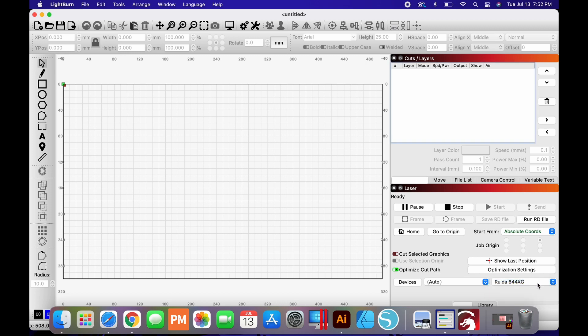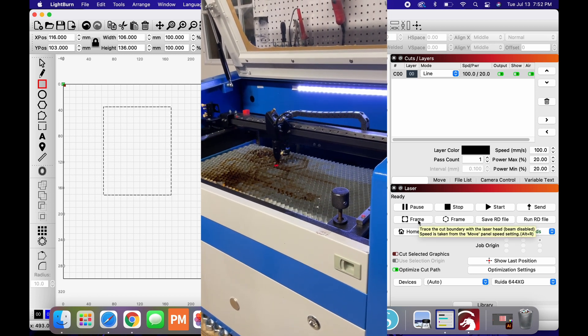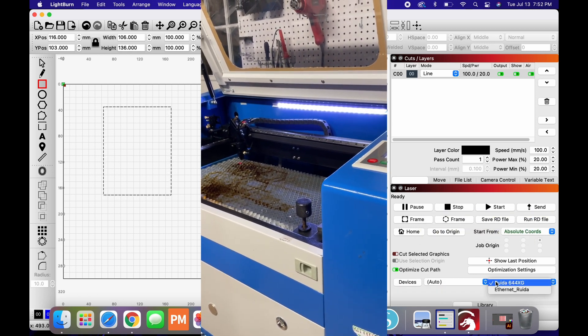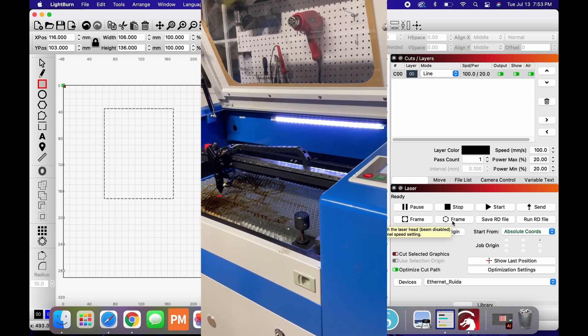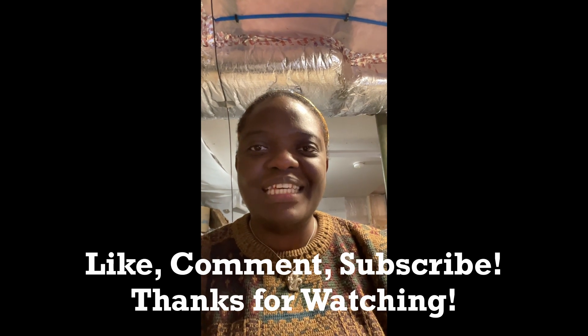So whichever one I'm going to use — if I click on Device I have the two listed here. Right now it's on the USB one. I'm going to draw a random shape in here. The laser isn't fully on, I just have the controls there. If I hit Frame, this is from the USB port so the signal is getting to it. Now I want to switch this to the Ethernet connection and do the same frame outline. You can see the IP address matches up and now it controls it. So that's how you connect your laser to the ethernet port and through a USB port to your laptop or desktop. Thanks for watching. Have a good day.